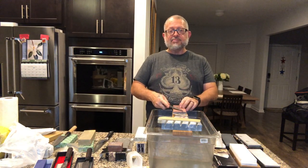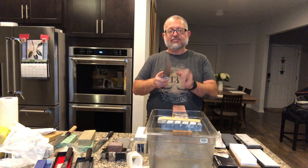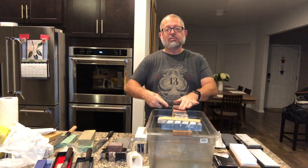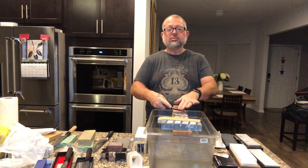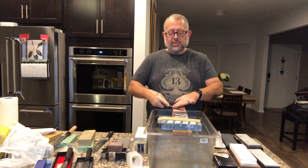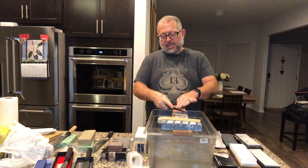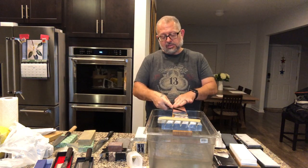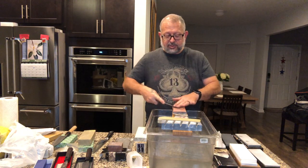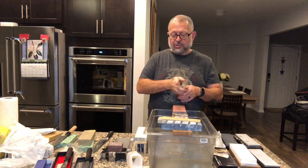So, yeah, obviously if you change your angle here, here, and here, you're going to have a much wider bevel in different places. So learning to get your hand just level, this just sits there, like it's almost like it can't even deviate anymore. I am looking at the knife's contact. I am looking at my hand. I'm not just over here, hey honey, whatever. So the stone's loaded up.